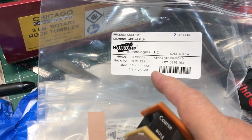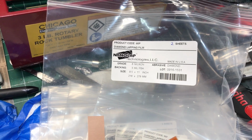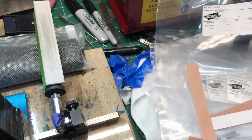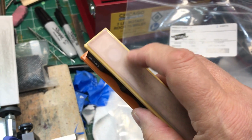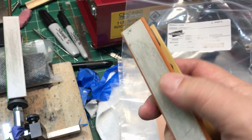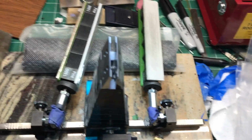They didn't know anything about it. They hadn't had anybody complain about it. So anyhow, I pretty much get a mirror finish when I'm down to about 1 micron. Sometimes I get a little bit better results when I go to the 0.5 micron. But even without the scratches, I don't see that much of a difference between the 0.5 and the 0.1. What else can I say?